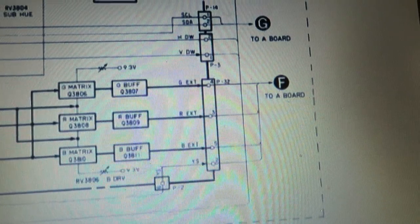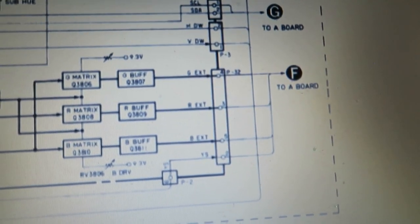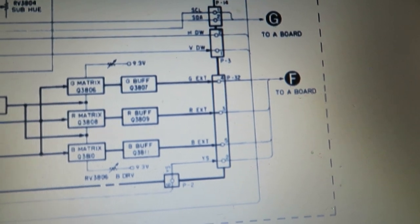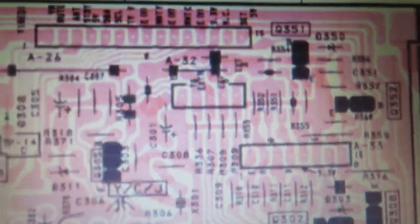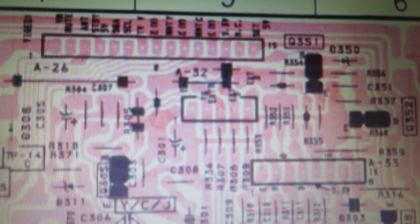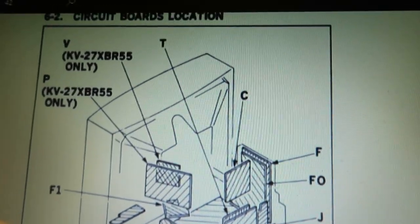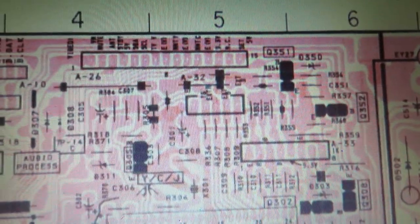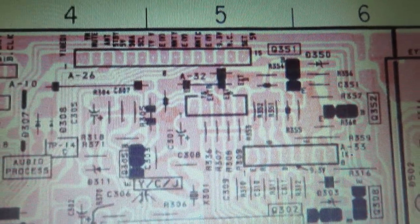Based on the note from the previous diagram, I'm not even sure how much of this is actually populated, so the next step is to just open the TV up and have a look. After a little bit of searching, I located the F connector — that 5-pin box right in the center of the screen — connected to the appropriate pins of IC301, the YC jungle. Looking at the diagram, boards V and P are not actually populated in this TV, so I'm not expecting to see the connector populated either.